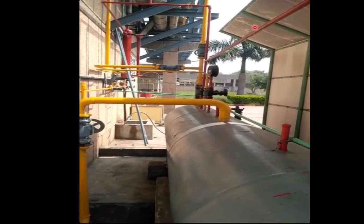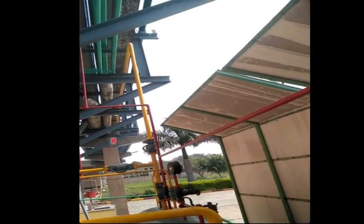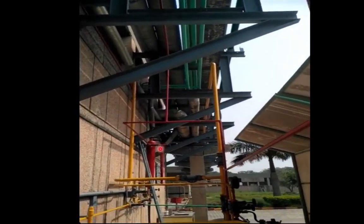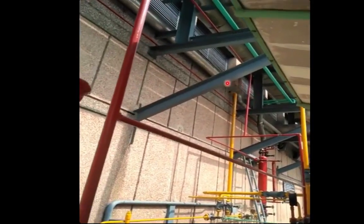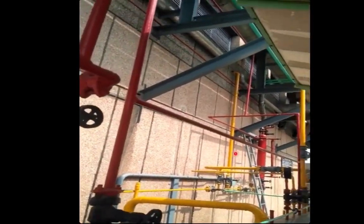This red colored pipeline is going to the farther away unit — that is the air purger. This red colored cylinder is the air purger. This yellow colored line entering here is going to the inside or to the LG cooler as well. We will be having this insulated line coming out. These two lines — one yellow colored line and one insulated line — are both carrying liquid ammonia. The yellow colored line will be having liquid ammonia at ambient temperatures, and the insulated line will be having ammonia at sub-cooled temperature for the ice cream deep freezer. The yellow colored line will be going to milk cold storages, and the insulated line will be going to other cold storages like ice cream and other frozen dairy products.